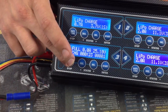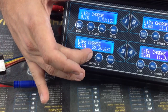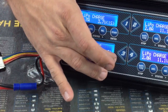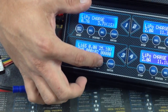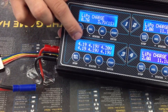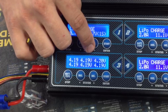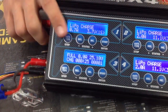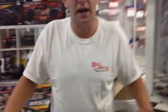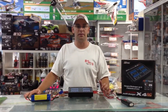I'm going to show you one other feature. If we go back into the LiPo setting and hold the start button, right beside the start button you can press the increase button and it'll show you each individual cell as it's balancing and bleeding itself out. It produces power through here and slowly drains each cell so you'll reach a maximum of 4.20 or 4.19 volts on each and every cell when you're balance charging. You don't have to balance charge every single time — it's a good idea so you don't forget, but typically you should do it at least every third time to make sure all the cells are even.